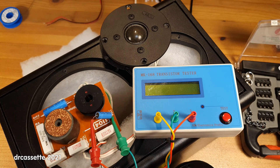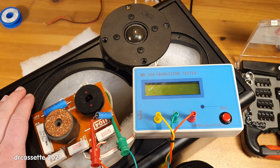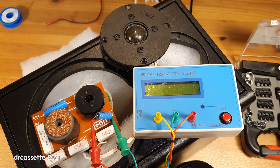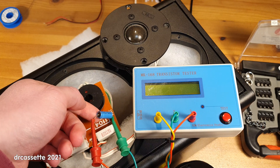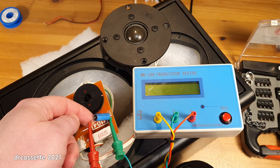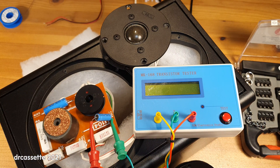This is quite an interesting problem, because these speakers were built between 1991 and 1993. The closest thing to a date code I could find on this capacitor indicates it was probably made in 1992 — so that's not that old. In the early 90s, capacitors were failing left, right, and center, but those were the first generation of miniature and surface mount capacitors, not these types of very simple traditional capacitors. But there you have it — the capacitor has gone bad and will need to be replaced. I have contacted the owner about what he wants to do, and he has not replied yet. So that's where this video ends.